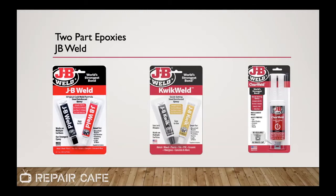JB Weld is usually the brand we're going for at Repair Cafe. The first one is the original JB Weld, a good choice for bonding metals and pretty much anything — it has a longer cure time than JB Quick. We typically go for JB Quick Weld at Repair Cafe because we don't have all day; we want to help our guests get their item fixed and go on with their day. JB Quick Weld has a shorter set time and faster cure time. But in the case of dealing with ceramics — a plate, a platter — we're going to use the Clear Weld. Let's see how Clear Weld works.